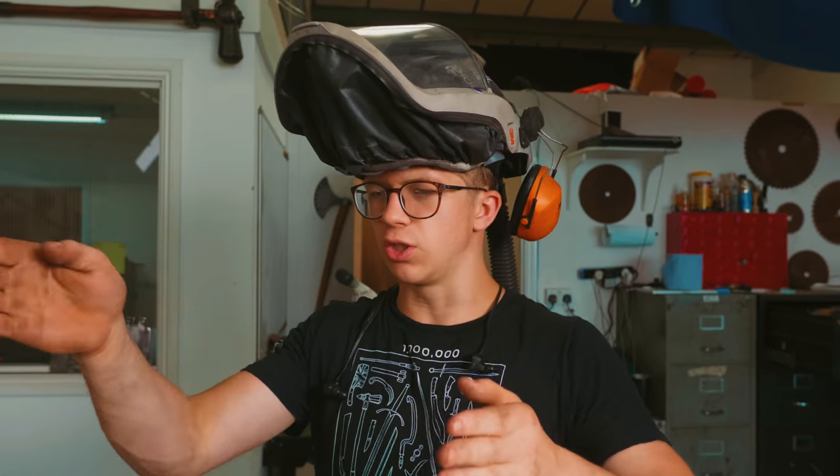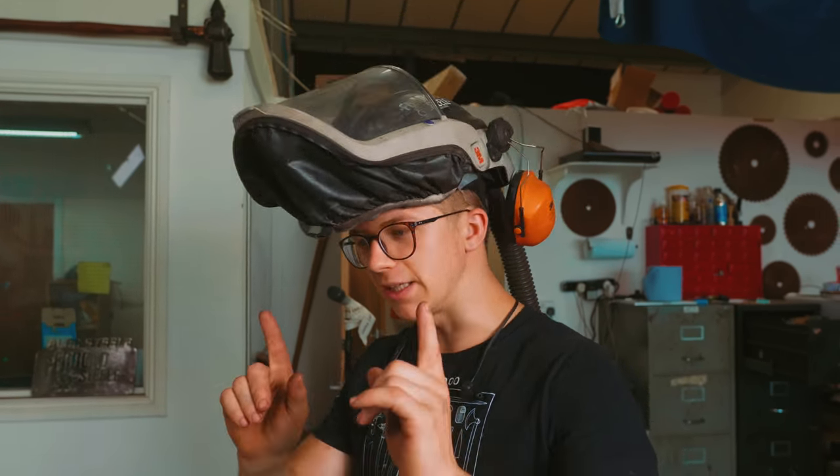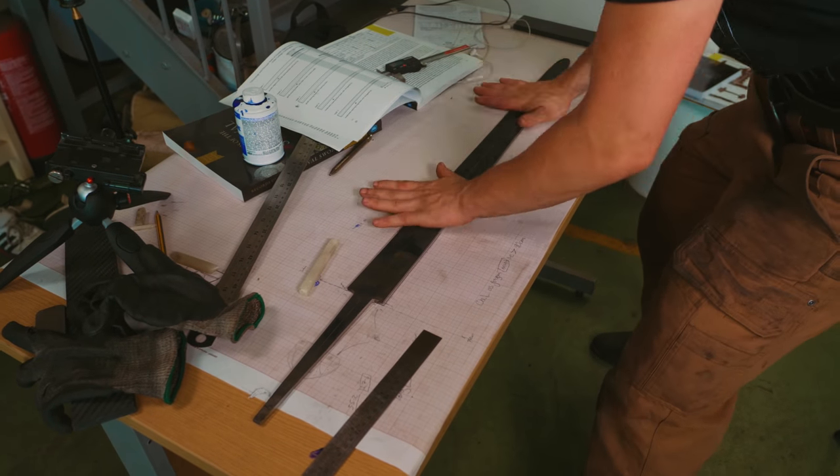And when you grind your edge, you're then grinding your edge to a profile that isn't where it's gonna be. It makes for all sorts of troubles and pain down the line. So I'm pleased. This profile is how it should be. The tang is straight. We have a beautiful scribe line and it is neat to it.